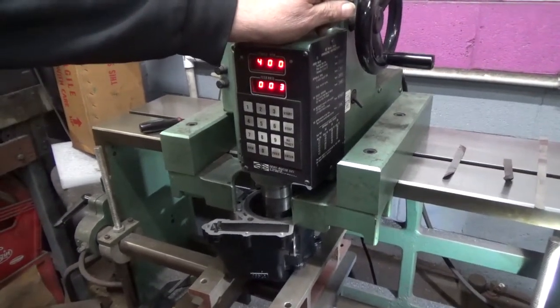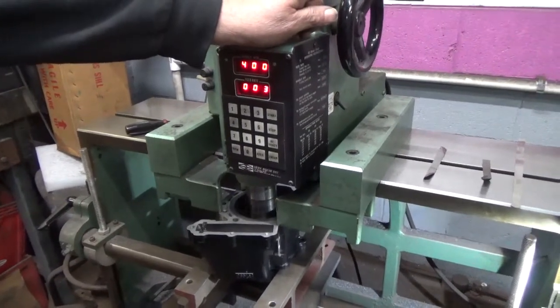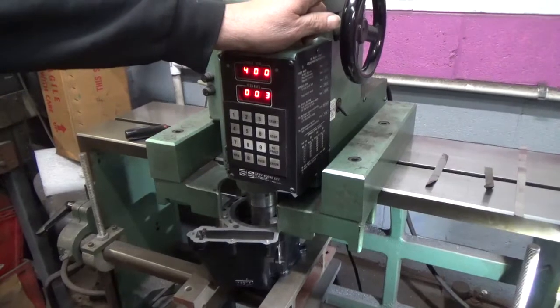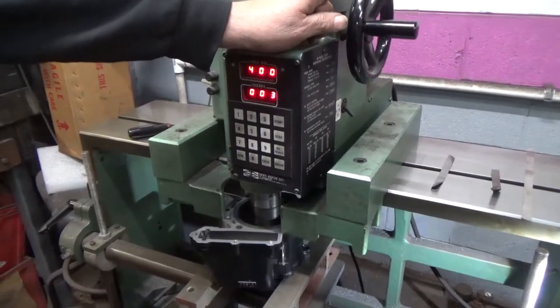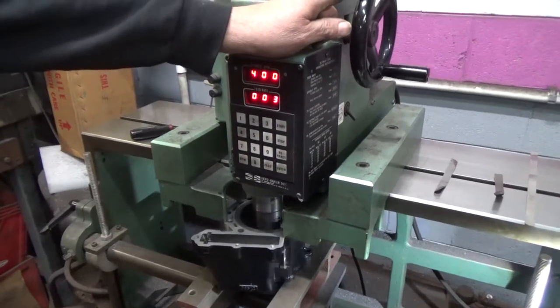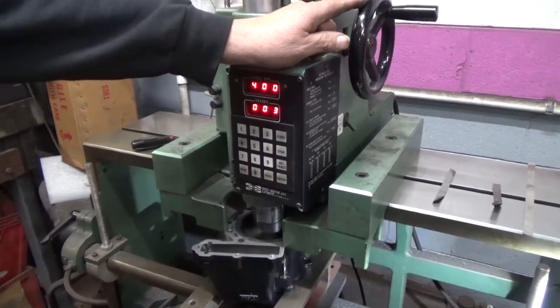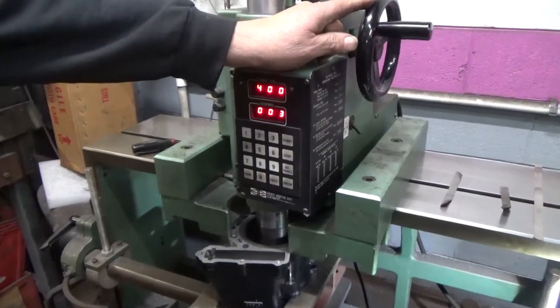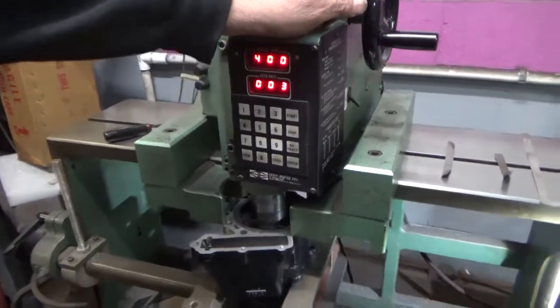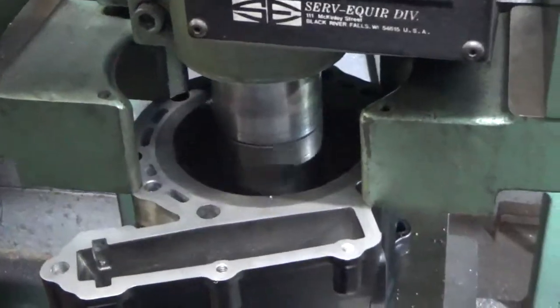I know — this is boring. Ha, play on words, right? So here we go, this is our first pass. This is the heaviest part of the pass at the top of the cylinder, and we may even get some hollow spots just right below this before we get up to our size, but we're going to let this go and run through the cylinder and we'll bring it back for the next pass.